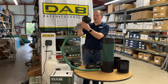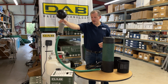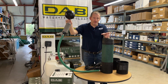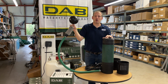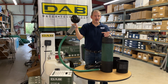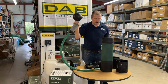And then when you get the 1-inch floating filter, we provide a 6-inch float. So as you install it, obviously this is going to float right below the surface, and the water will always go into the pump from here and get filtered and then come out the top. The top has a 1 1/4-inch female threaded outlet, and you'll just put your adapter in here. You can use PVC pipe, you could potentially use PEX, I suppose, if you like, on your discharge.